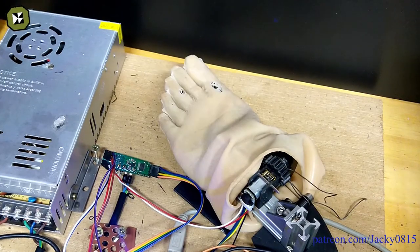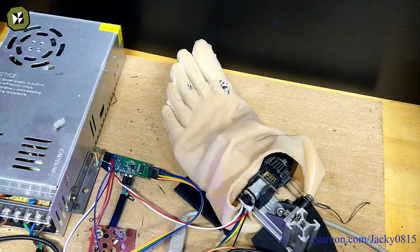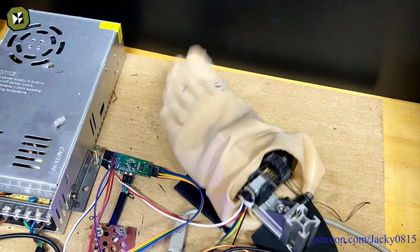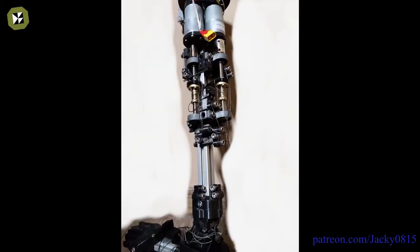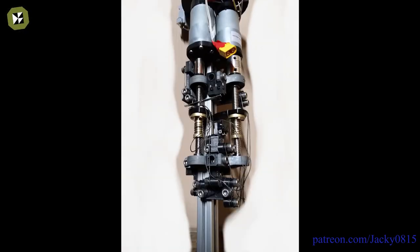In June I tried again to put a small N20 motor in the foot, which partly worked but made me realize that I should put a bigger motor for the foot in the thigh. Around July I had installed the end stops for the joints, but during the test I found that the self-printed pulleys had too much friction, so I replaced them with mounted pulleys.